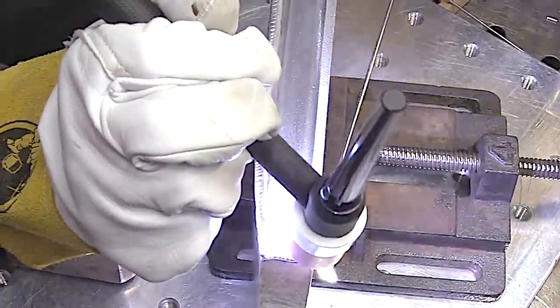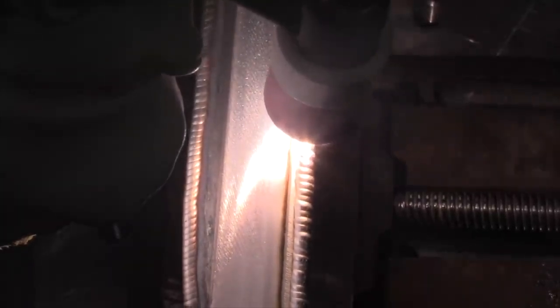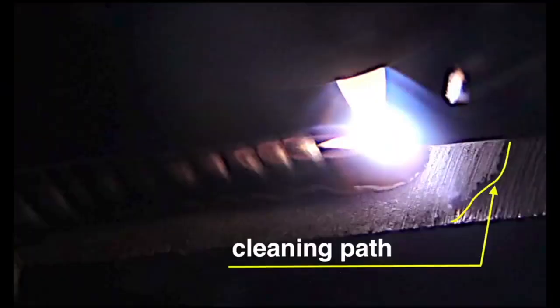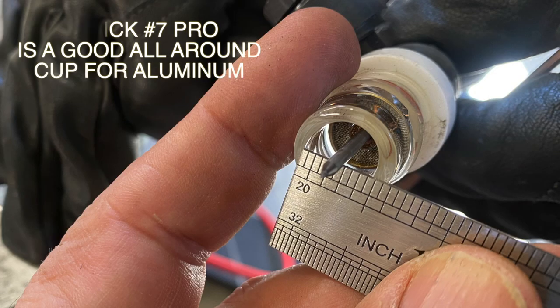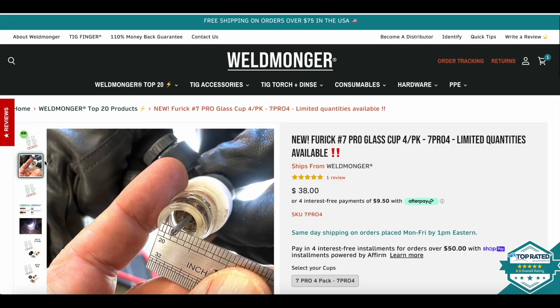For cast aluminum, you do what you can do. You grind, you use a carbide burr, you wire brush, you get it as clean as you can. But sometimes there's just still stuff in there. One thing I've found to help is to let that cleaning action do a little cooking first before you puddle the metal, and also a gas lens helps. I like a number eight for cast. A gas lens actually makes that cleaning action fan out a little bit more than a standard cup. Another thing with cast aluminum is just not to outrun your cleaning action. If you've got some tricks for cleaning aluminum or a preferred method that works great for you, drop them in the comments — we'd sure all like to know.